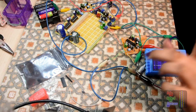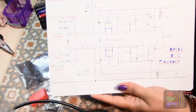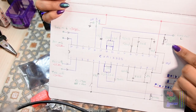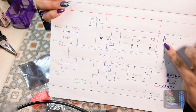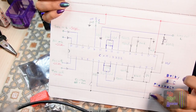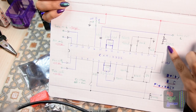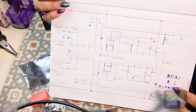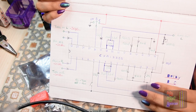The circuit, but just to show you the amendments I made on the circuit diagram to get this to work, because it took me some time. So the only thing basically I did was I put two variable resistors, as in stabilizing resistors, on the output. Not on the input, on the output itself. Input's fine. That's literally the only thing I've changed. So, stabilization is 500 ohms each potentiometer. And I just turned it, adjusted, and everything was fine. The distortion and the clipping and everything disappeared.